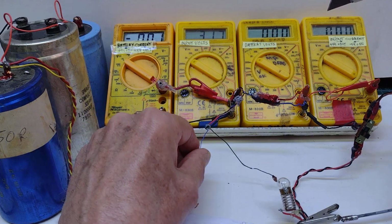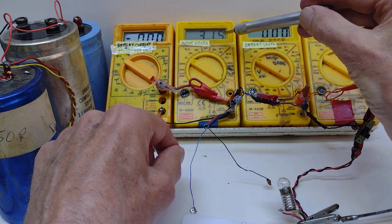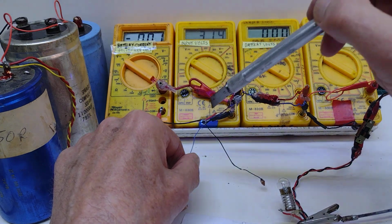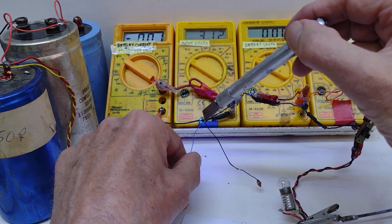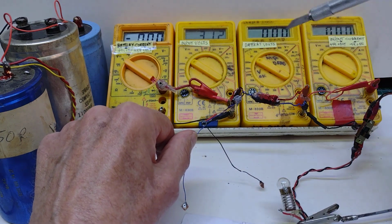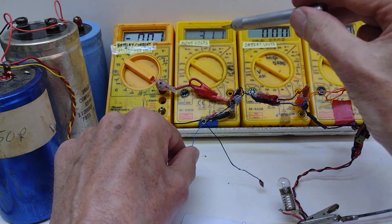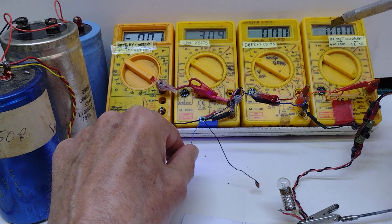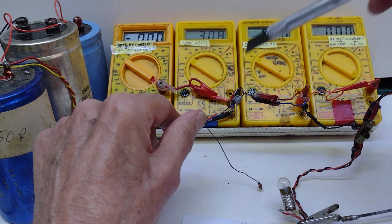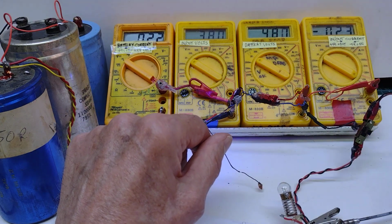we'll notice now that it's gone down below 3.2, and when I touch it, it doesn't give me an output, but it flashes blue. And that's what I must have seen at the side of the road on the vape I picked up. So yeah, as long as it's below 3.2 volts, it gives me no output, but flashes blue. I can recharge it again by sliding my slide switch across.